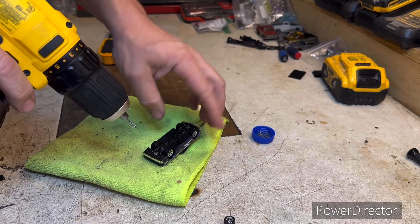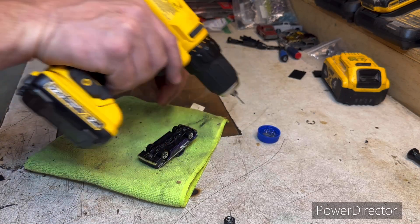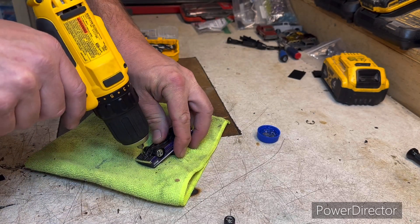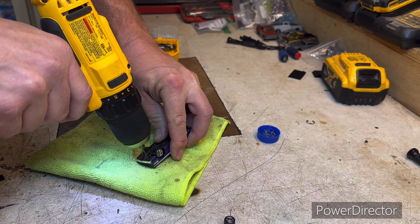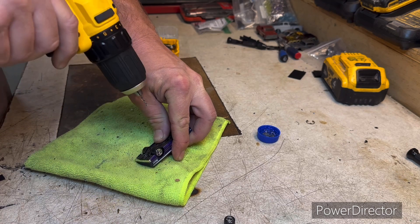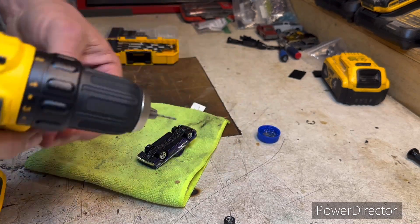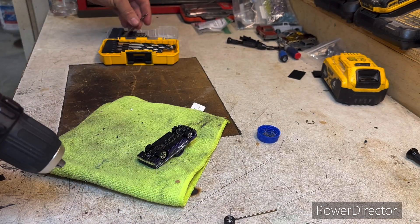I always take and drill the center of this out just a little bit first. That way when you go to the bigger drill bit, always keep it clean — drill for a second then clean it. Keep a little WD on the end of it; that sure does help with the cutting oil effect. You can see the shavings coming right up out of there.